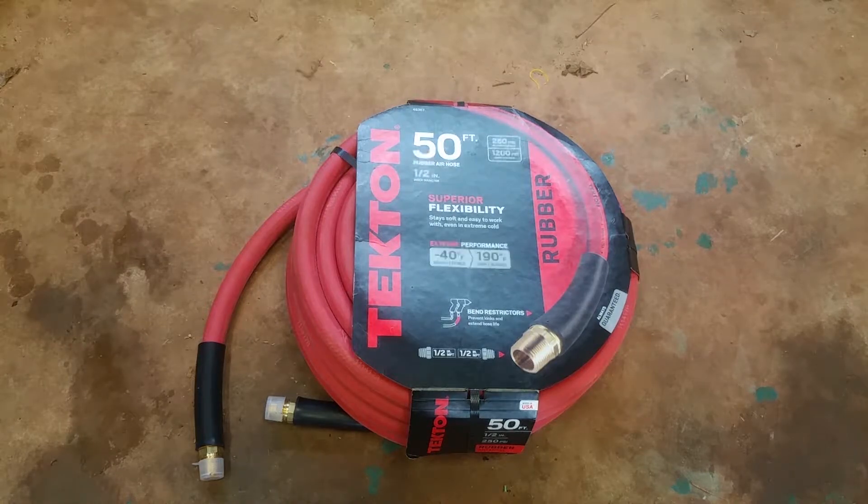All right, what's going on y'all. I got a quick tip for y'all when you're plumbing your hose reels. My hose reel is 3/8" — that's the diameter of the hose on the reel — and plumbing into the hose reel you see a lot of guys they'll just use another 3/8" hose and plumb into the hose reel.